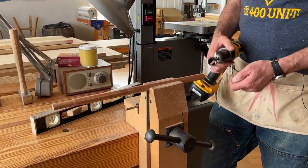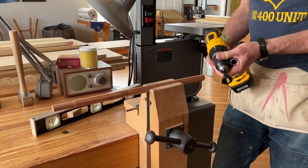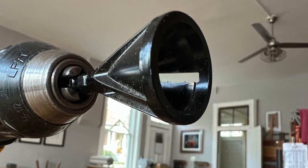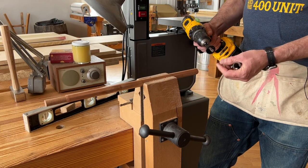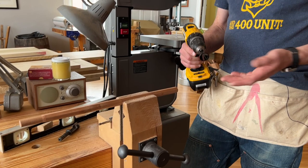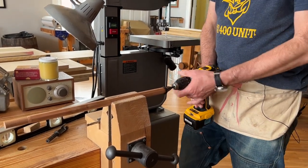The cheap way to do it is to start with a chamfer slash deburring tool. This is a metalworking tool that chamfers the ends of bolts — it's designed for cutting steel. You can buy these for less than $10 and they cut really well.